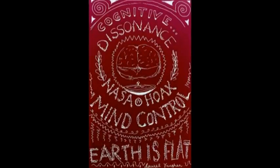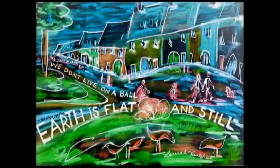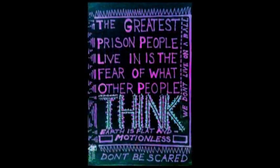And it's like, no. In reality, perfect vacuum is not possible, because it all has to do with the relative amount of atoms within that given space that determines the level of vacuum. Okay. So then you have high vacuum, which is 10 to the negative 3 torr to 10 to the negative 7 torr. And then there's ultra high vacuum, which is where I was in, 10 to the negative 7 torr to 10 to the negative 11 torr. Wow. Okay. And then there's extreme high, which is negative 11 on down.